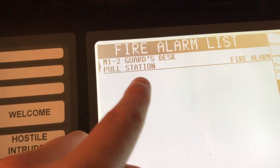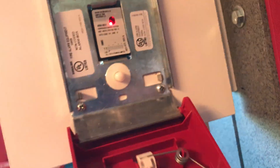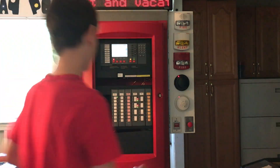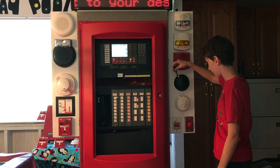Then we can go right here and reset it. I'll show you inside: there's the LED going through a glass LED tube — it's thinner and lighter — and under here is where the address gets set. Now we're going to set off one of the smoke detectors — the black smoke detector on the right side. We're going to walk over here and put the magnet right next to the LED, just like that.